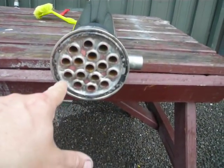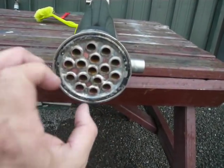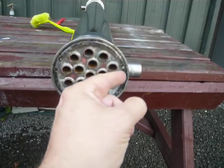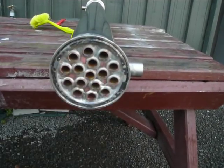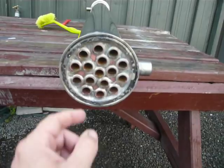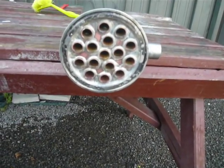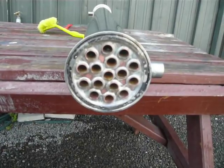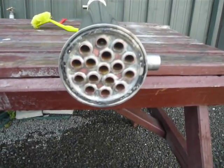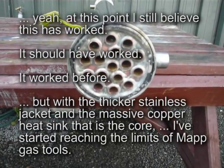What I've done on the inside is tin the ferrule and run a bead of solder around the outside of the baffle — same on both ends. I slid the core in, then heated the outside until the solder started merging, and helped it around with silver solder wire until I got a nice meniscus. I've got a bit of cleaning up to do where I've splashed solder over the edges. Soldering copper to stainless with low-temp solder is a pain — it's very temperature-dependent, and if you go a bit too hot you end up burning your flux.